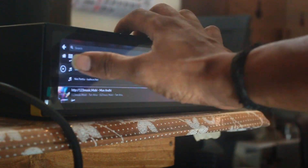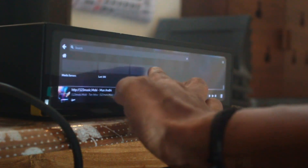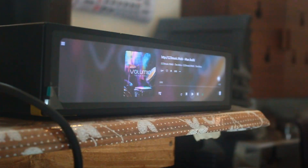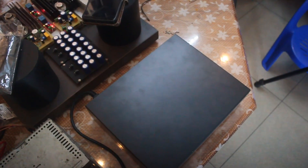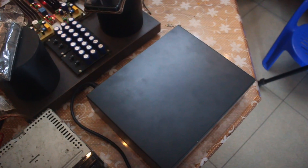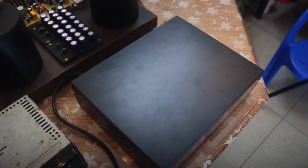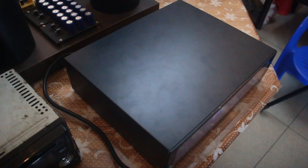Touch is very smooth and nice. High-quality powder coat paint is used in the cabinet. My decision was to make a baseless DAC player. At the end of the video I am playing a Malayalam Indian music. Raspberry heats up so it is better to use a fan that works at 5V. Low noise fan is available in the market, try to use it.